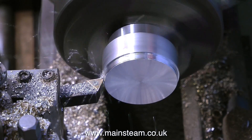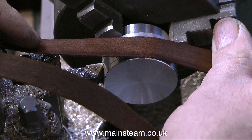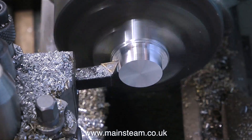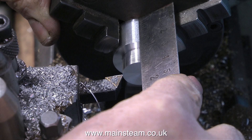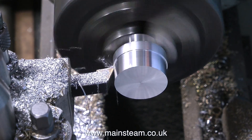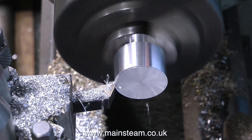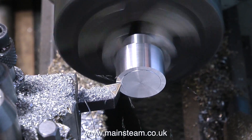I've turned the piece of aluminium round in the chuck and I'm machining the other end. I don't want this pulley to look big and clumsy, so in this clip I'm using the leather drive belt to tell me how much metal to leave on each end as a guide for the belt. I'm turning down the front to remove quite a lot of material — taking it down to approximately three-quarters of an inch — then reversing it in the chuck after measuring to confirm it's correct. The flanges at the end of the pulley need to end up about one inch in diameter.